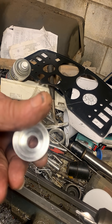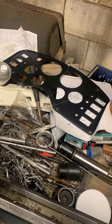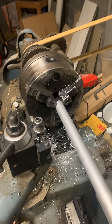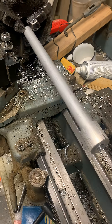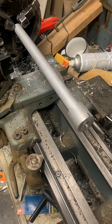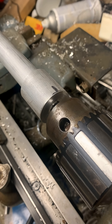This tool fits around the rod tightly on one end, and on the other end it fits around the centering drill. So when I put it on here, even though the rod is that long, it won't wobble. The center drill then drills the hole in the proper place.